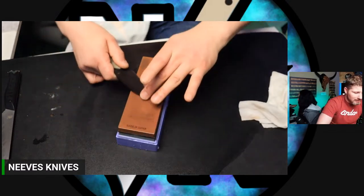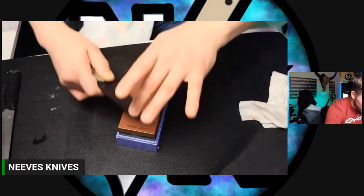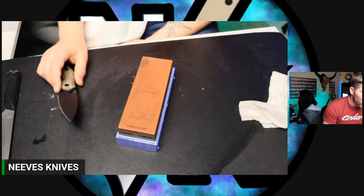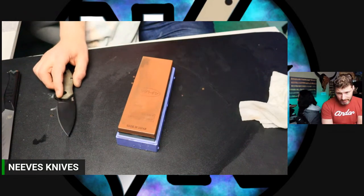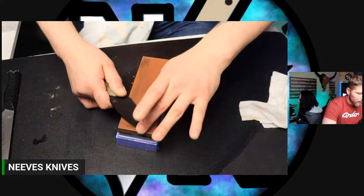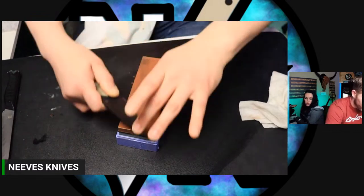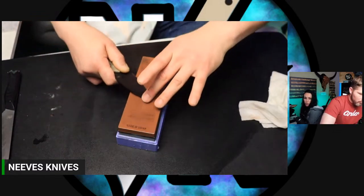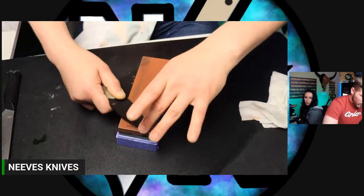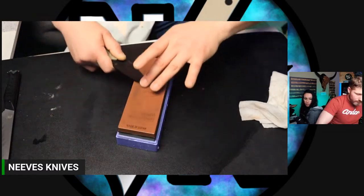So it just depends on what you're wanting, what you have, because lapping films, that's like saying stropping compound or sharpening stone. What grit is it? What micron is it? You've got to know what micron it is, so you know exactly. I think the thing that I saw, he used a lapping film that was subsequent to what he had just sharpened, so it wasn't like he went back out of order and started over with lapping films. He did it as a fine tune between that and the strop, whatever.